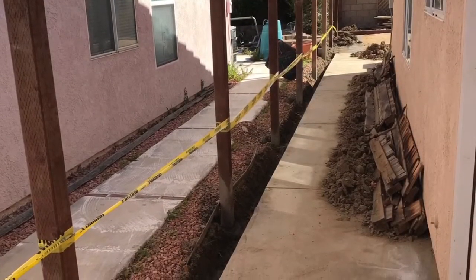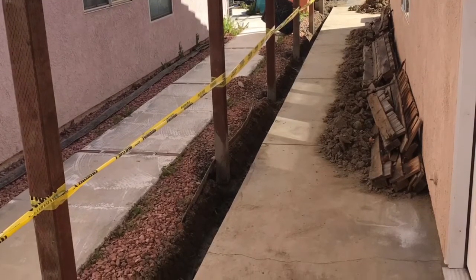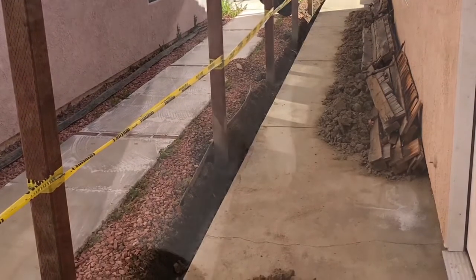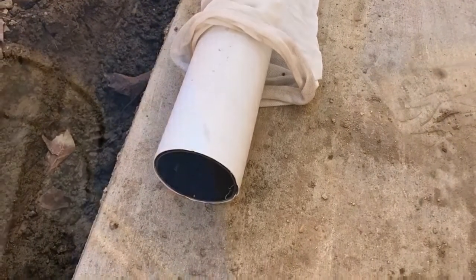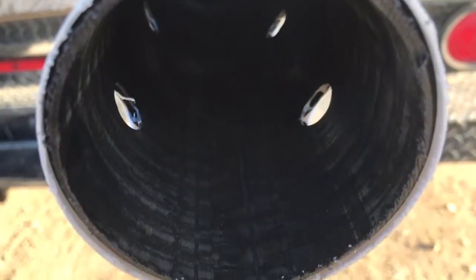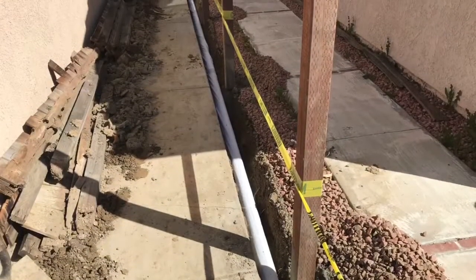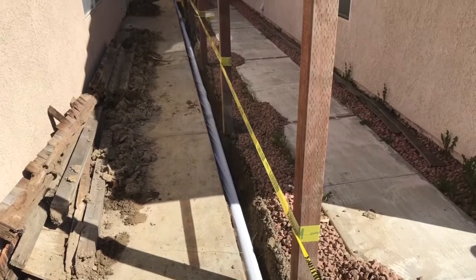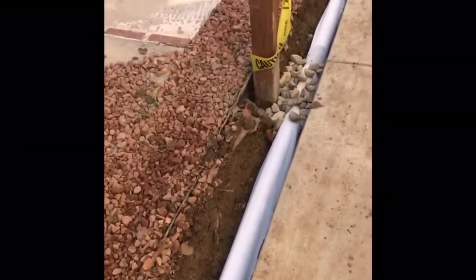There was about 50 feet worth of fence where water would just stand and sit. So we figured the best thing to handle this would be a French drain made up with a three-inch diameter pipe perforated with holes that you turn downward. Inside, you can see there's a little trough where the water, as it comes in, will sit. And even though the pipe is pretty much level, the water will flow out. There was a very slight downward slope towards the front yard, which helped.